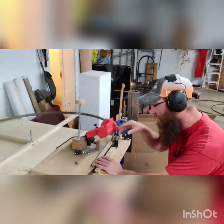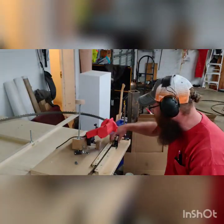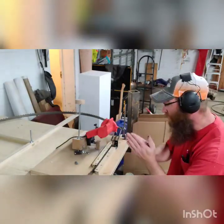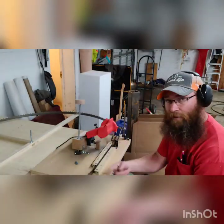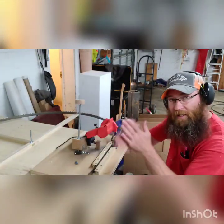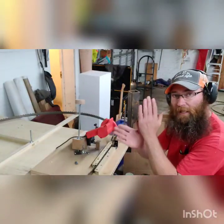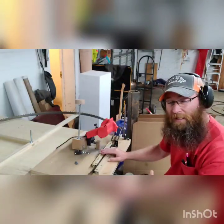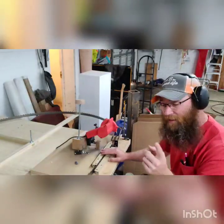to make sure that you hit all the teeth, because there will be gunk that builds up on the front of that tooth sometimes. And if that gunk is on there when this bar hits it, then it might throw off the spacing, meaning that the tooth that's out here actually gets pushed just a hair further so it doesn't get hit. But as it goes through here, the grinding stone can clean that gunk off the face of that tooth so that when you go around the second time, everything should be exactly where it's supposed to be, and you hit it, boom, boom, boom, boom, boom, boom. But as you can see, I think I'm going to try to do this uninterrupted, and then we'll time it and see just how long it actually takes for me to go around one time with this blade.